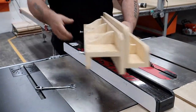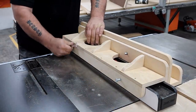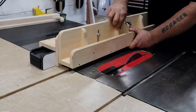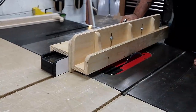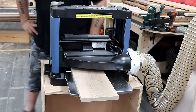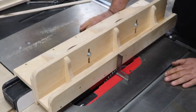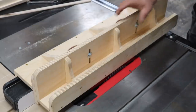To install this thing, the H side just slides right over the top of the fence, and then you tighten these two bolts down — you could use knobs if you wanted. On the other side, you can raise and lower the J component with these two bolts that go through to the nuts we installed earlier. I'm able to raise it up, tighten it down, and bring the fence right over the top of the table saw blade.